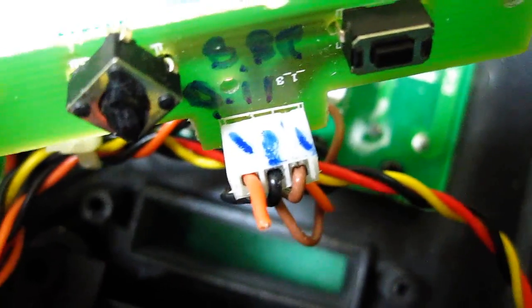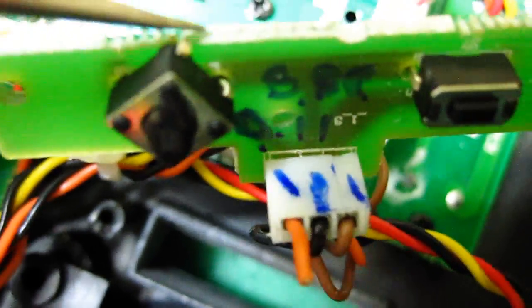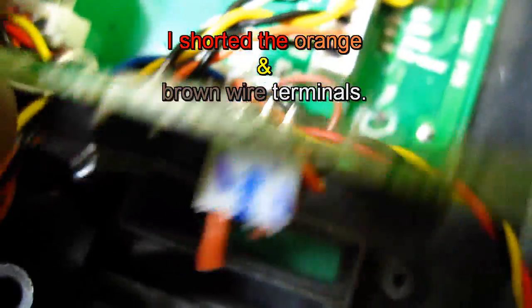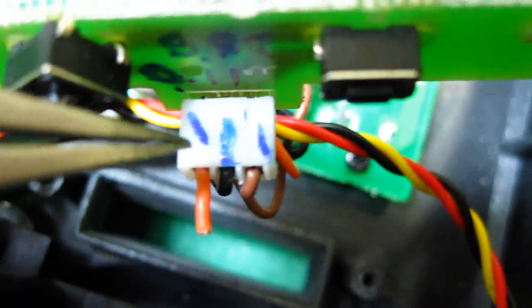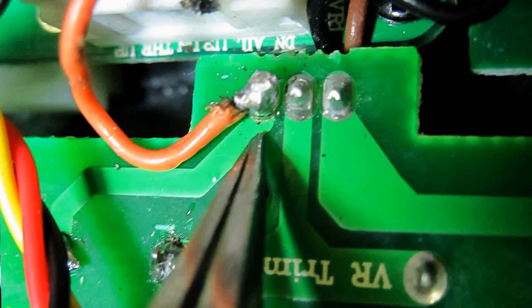I've been flying this thing for five years through 20 below, high winds, rain, snow, fog — you name it. What it looks like happened is that even though I unplugged this plug, it's obviously not the switch that went bad since I just changed that. By shorting the wires out together I got it to work, and on the circuit board by shorting out those pins on the opposite side. What I found was that the wire inside the connector — the wire that's cut right there — is corroded or something inside the actual plug. It won't make contact, or if it does, it's intermittent depending on temperature.